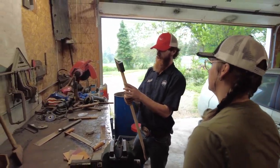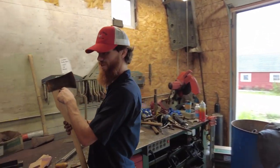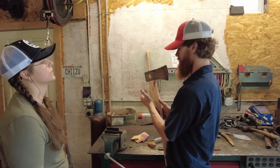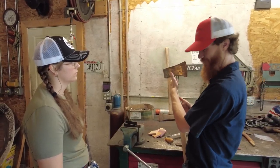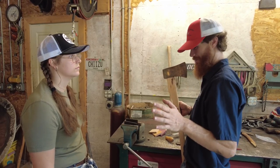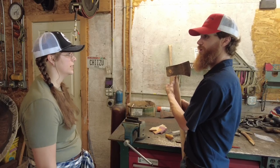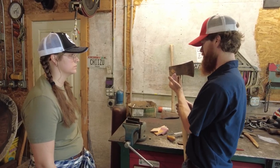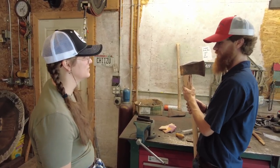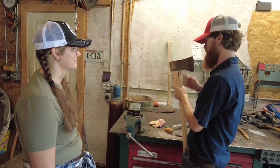The best bet on a handle like this is you could take off the front, but then that head's going to be set back in the handle. So instead, you want it to be parallel in the front. You don't want to take much material away, in my opinion. The internet may have other opinions on this, but you could take the shoulder and hang a really small head on this and just make this shoulder more pronounced. So we're going to end up taking material off the back and making it smaller in this direction, and then it should be further down.